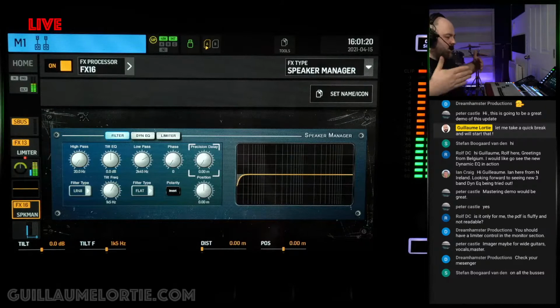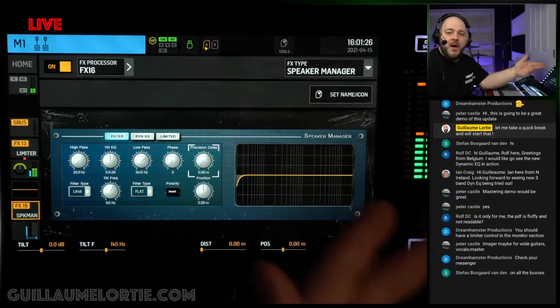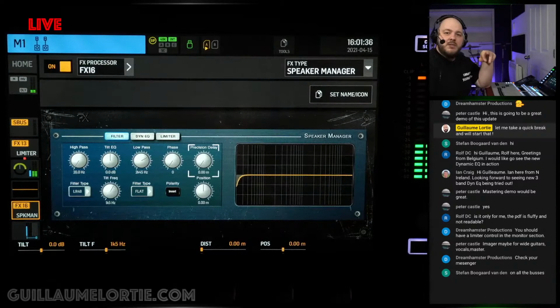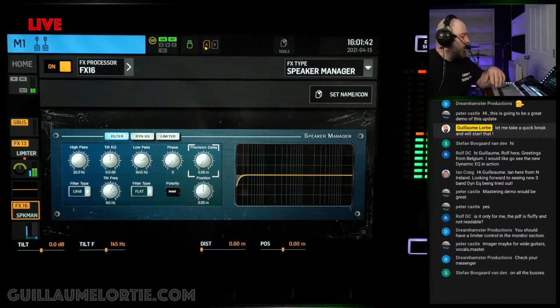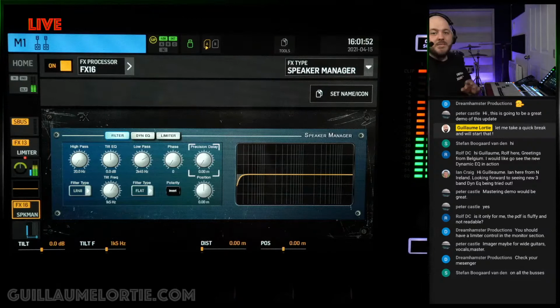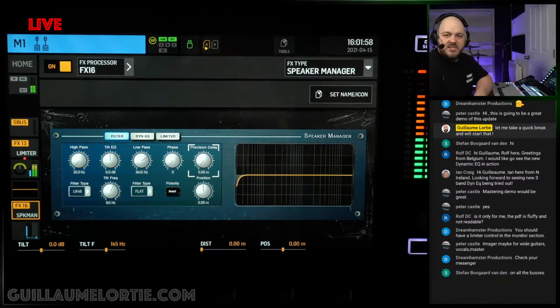Also, something that I like to do is a cardioid pattern on my subs. In a festival that I'm doing, I'm using three subwoofers, two facing the crowd, one facing the stage. I take the middle sub that I put in between the two facing the crowd, and I phase reverse and delay that sub until I get a total cancellation of subwoofer in the back. So that way the sound is really destroying everything up front. People get crushed in the front row and the stage is quiet subwoofer wise.